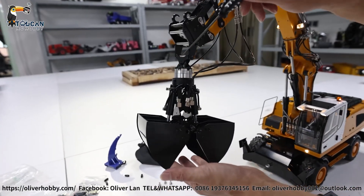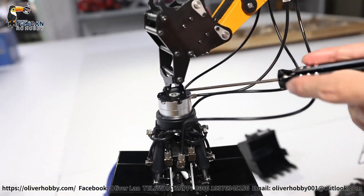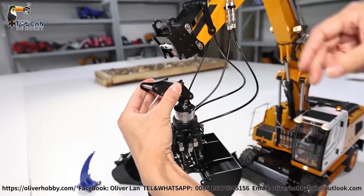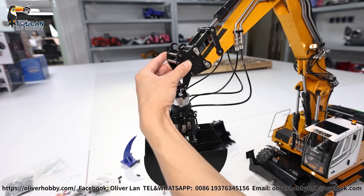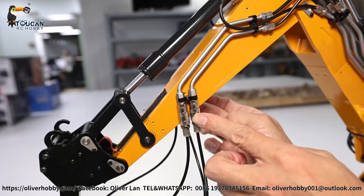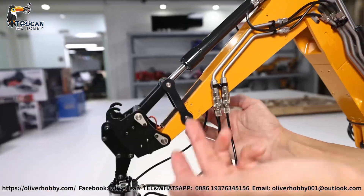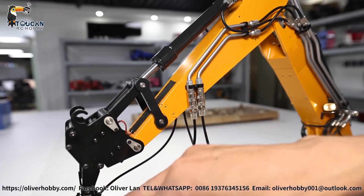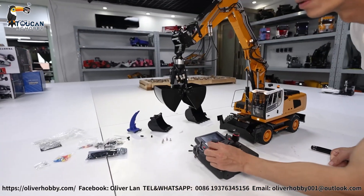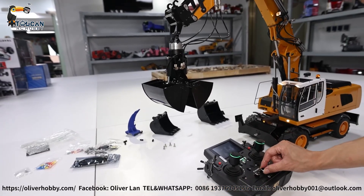For the clamshell bucket, this connection — only three screws. Original here have black screws, three screws secure it. These two holes are for rotation at the back side. Here, see the connection? Unlock — servo unlock — that's how you hook up. Hook up, lock it. Front left and right: two holes for rotation. Back side and right side: these two holes for connecting to the bottom — this opens and closes the bucket. Left and right is one channel — do not mix. If you connect these two together, you will break the rotation. Rotation only: one left, one right. For operation, rotation by VRF. Open bucket: VRG. Close and open. Start the pump at idle speed for more power.